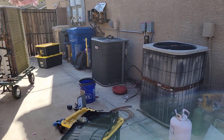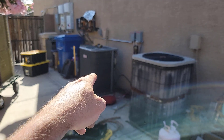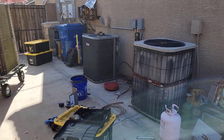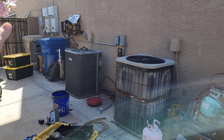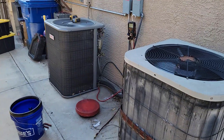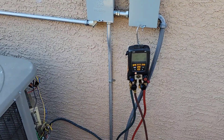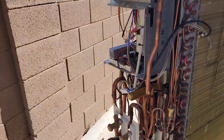What is up? Getting ready to finally attempt removing that cube outdoor unit to put in this tall skinny one over there. Step one of putting in two of those and freeing up all the space right here so I can back my trailer in finally. I've got that pump down, just close the valves, then I'm gonna go ahead and cut the lines and connect it and just hope everything is ready to go. It should be.